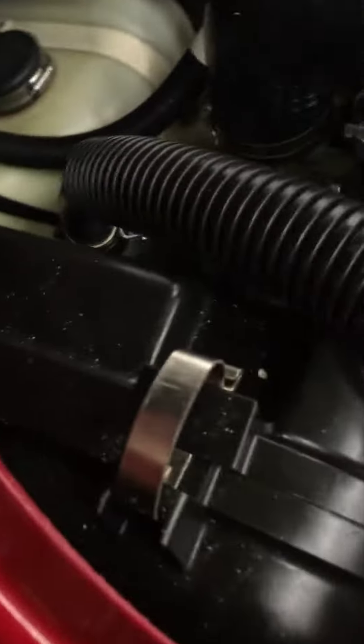Air filter looks good in there. Went ahead and greased all your jet pump linkage, steering, and all that — connected up from here, greased all the fittings. Everything moves nice and freely. Jet pump looks good in there, nice sharp edges — don't see anything caught up in there.